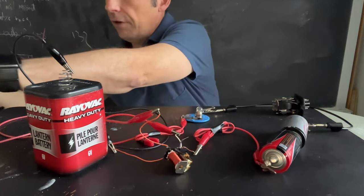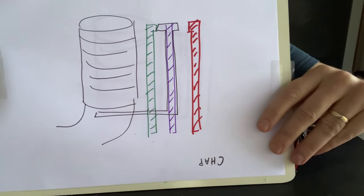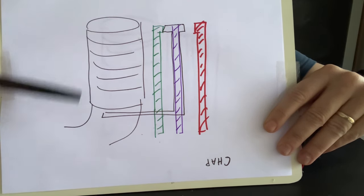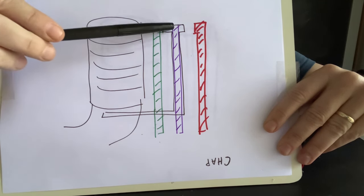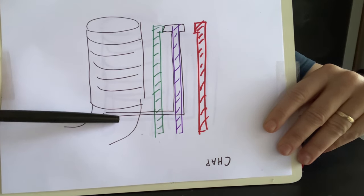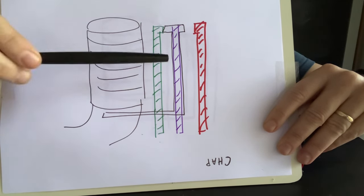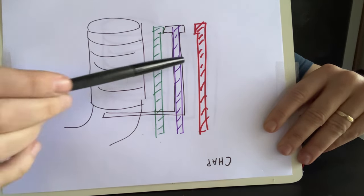So how does it work? I've got a little diagram right here to kind of help us think about what's going on. We have here a coil of wire, and it's hooked up to a power source — this is an electromagnet. When you turn on the electromagnet, this bar right here gets attracted. And when it does that, this moves that way, because the whole beam — this beam has this little shape — it's going to get pulled and it's going to move that way. So now you can control the current in here and it can change these switches.